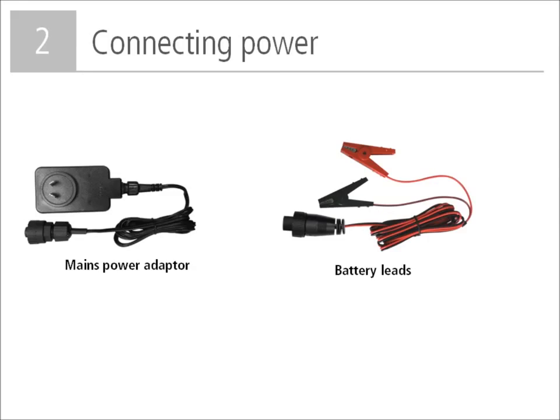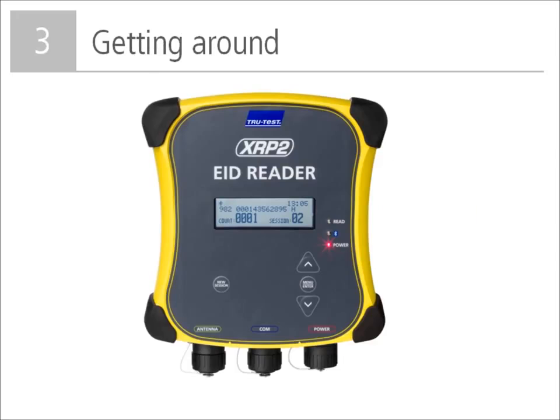Connect the red clip to the positive terminal on the battery and the black clip to the negative terminal. Alternatively, the panel reader may be powered by mains power using the mains power adapter. There is no on-off switch. When power is applied, the unit will automatically switch on and the red power LED will illuminate.